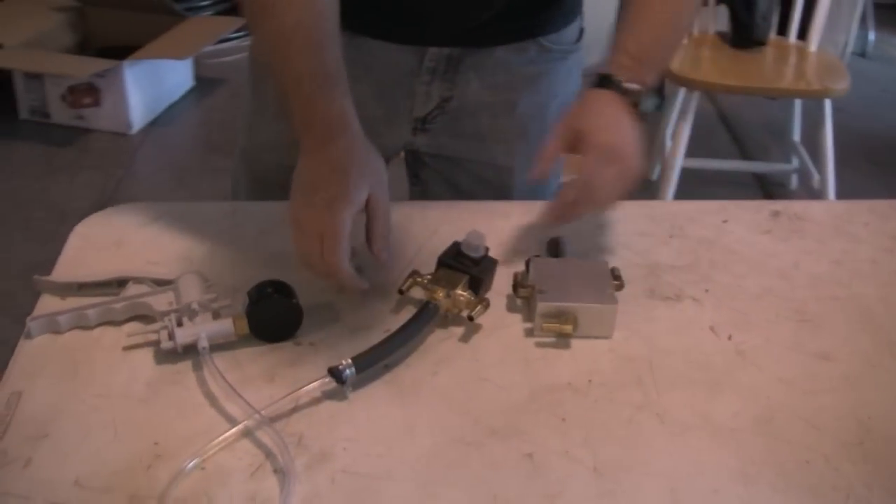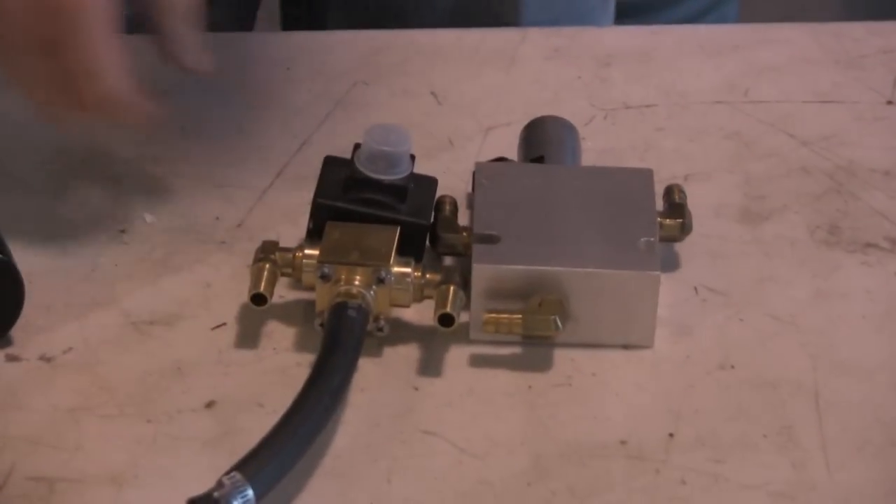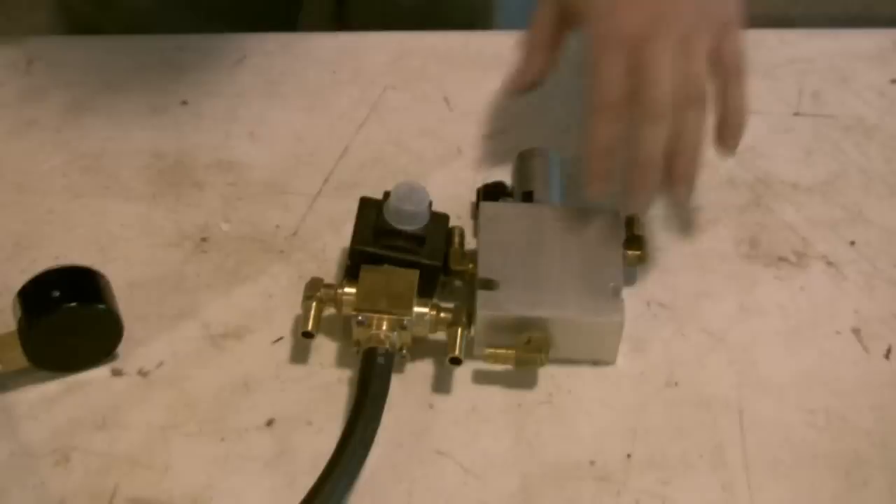That's just the last little test. As you can see the size — these are physically quite a bit smaller, a lot more compact unit. We've got the vacuum test showing that these HydroForce valves do have internal leakage, and this is just one more reason that we're very pleased to introduce these valves. I myself had these on one of my rigs and learned the hard way that if you empty one tank it'll suck air because of that internal leakage problem. Now we've got a product that will overcome that. We wanted to show flow tests and vacuum tests so that you guys can get a feel for what's going on with these valves.